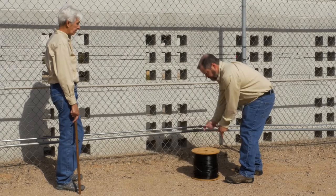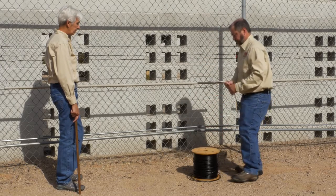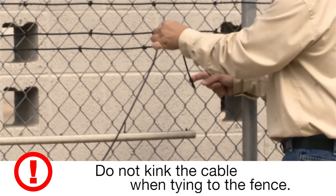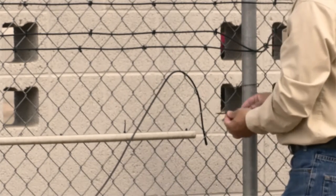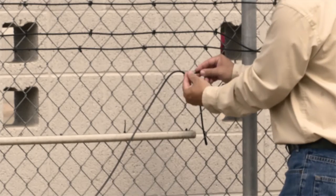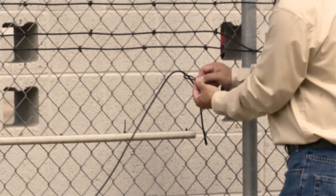The micropoint cable is typically mounted on the protected side of the fence. Using tie wraps, secure one end of the cable at the location where you will be starting your installation. Leave enough slack cable beyond the starting point for connection to sensor electronics.